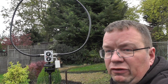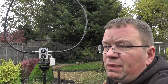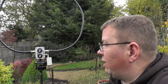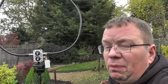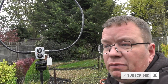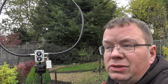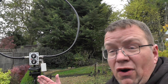So there we go — the ZFGL loop that I picked up from eBay a few months back, around about £79. Some specs say it does 5 to 30 megs, other specs say it does 5 to 30 megs plus UHF and VHF. On 20 metres I've got it down to about 1.7 — I think that's the best I've ever had it on this. I'll keep playing around with it to see if I can get it any lower. We could probably put a tuner in line and that should bring it down even further. It's only a QRP loop, 20 watts. If I'm going to use it on 20 metres and 40 metres and so on, I want to use it with my Xiegu X6100. But definitely on 2 metres the SWR was around about 1.2 to 1.3, and we made a few contacts on 2 metres sideband, around about 25 miles away each contact. So finally we're getting somewhere with this loop.